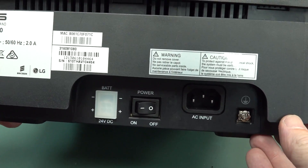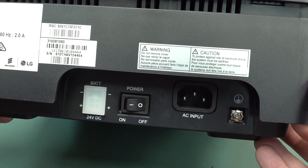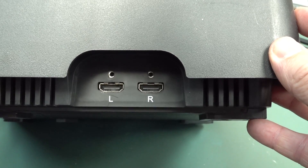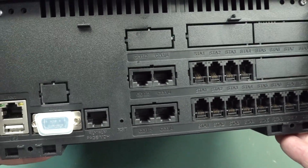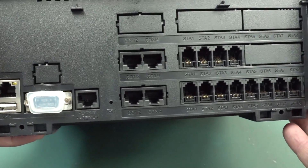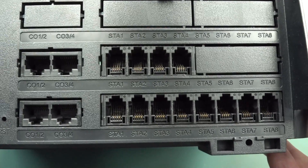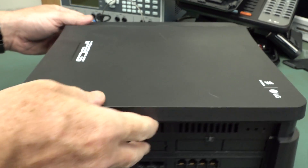Let's have a look inside this thing. AC input, external battery of course for when the power fails — you still want to keep up and running for a little bit. And on the other side — HDMI. But they're not really HDMI, they just use the HDMI connectors, left and right. I don't know what they're for — I don't think they're external monitors. Little RS-232. You've got your LAN interface as well. USB. Relay, paging relay and stuff like that, so you can put it up to old-fashioned paging systems. And a whole bunch of RJ11s. I suspect there's going to be a huge amount of wasted space in here.